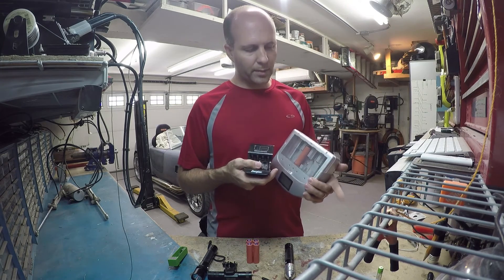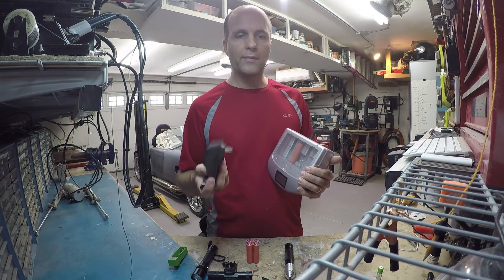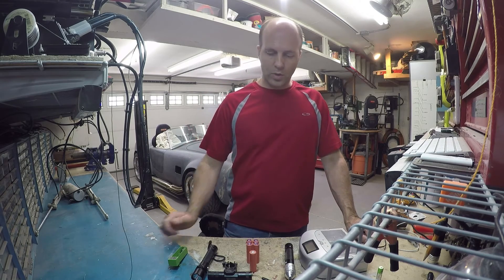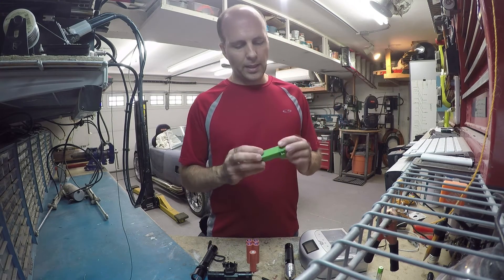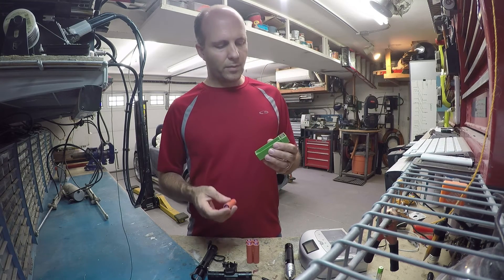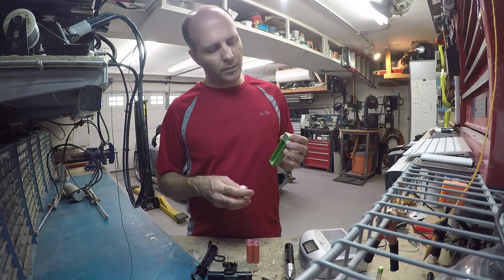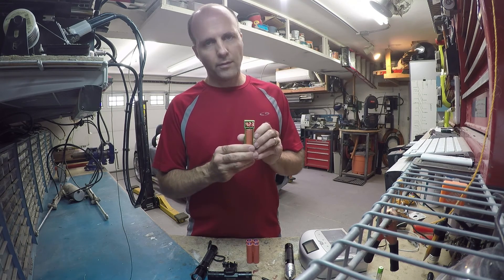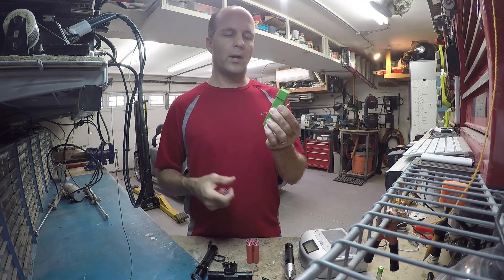These other type of chargers — you stick batteries in them and they seem to be on a timer, and so they will reduce the life of your battery. So I showed you where to get the batteries, I showed you what you can do with them, and I showed you how to get a charger. And then I even built a little 3D printed battery tester. You can buy these little voltage meters for like $2 on eBay, and you can check the voltage — this one's 4.24. It has a little ejector in the back so you can eject the battery out.